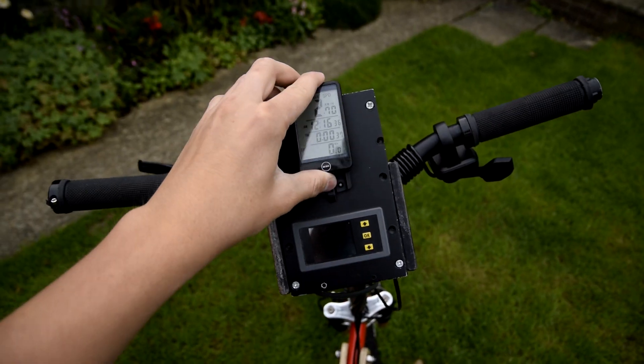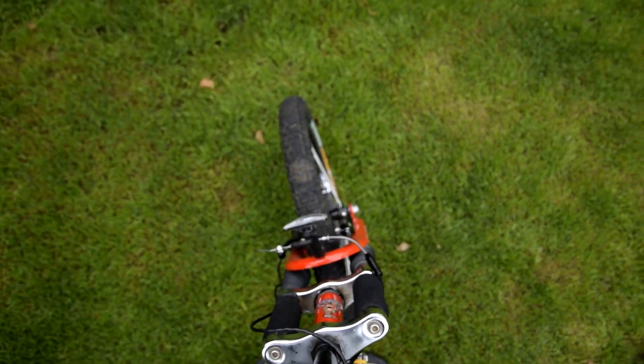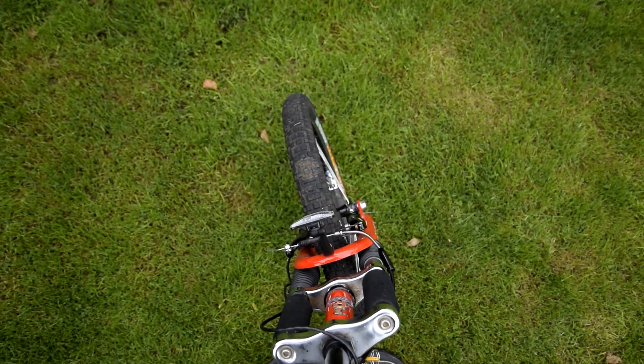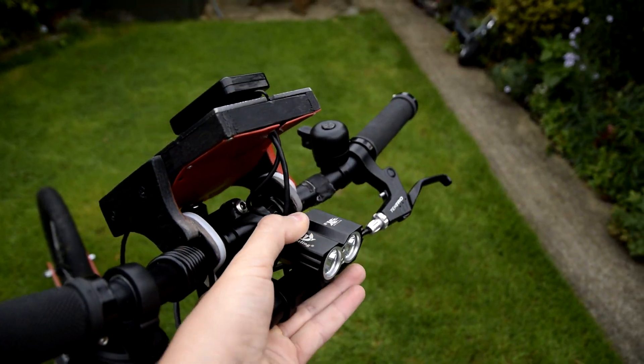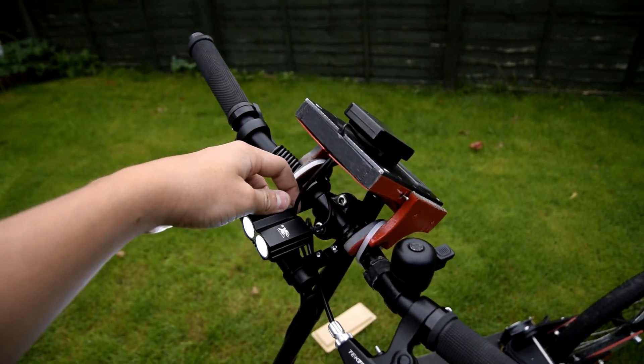With the electronics at the moment, at peak they're each allowed to draw about 2.5 kilowatts. However, on the flat at full speed they only draw 900 watts each. The front light is powered off the main batteries with a step-down voltage regulator.